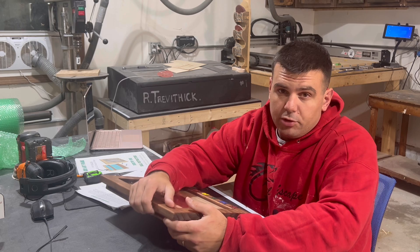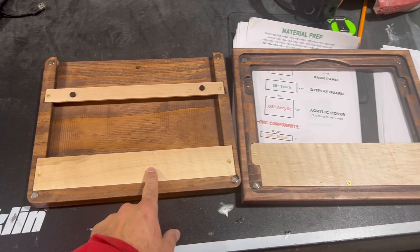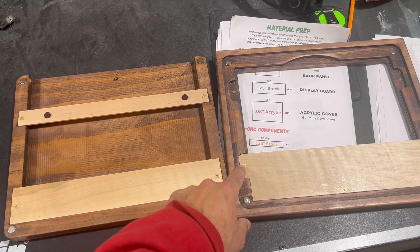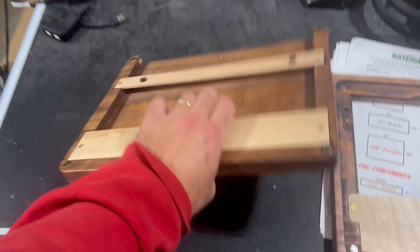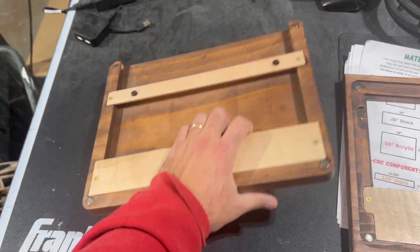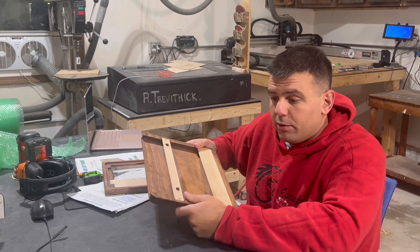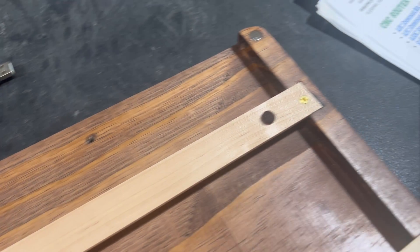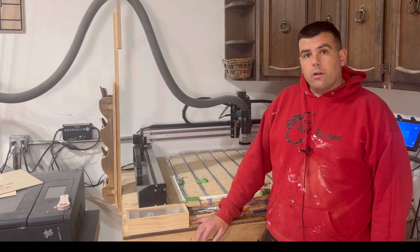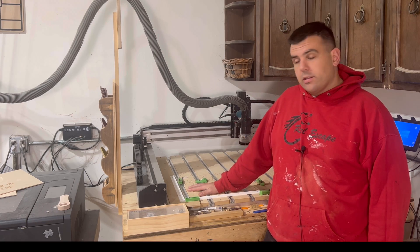Because this project is made on the CNC machine, some of the components are carved to fit specifically sized hardware. The smaller components on the front cover and back are held in place with screws — I'll put the sizes on screen. You'll also notice two small felt pads on the front and four on the back; those are totally optional, but I'll put the link in the description and build plans. The most important thing you'll need, designed specifically to fit this project, are eight neodymium fridge magnets from Amazon. These are carved to fit in pockets in each corner of both the rear panel and the front cover, and are what hold the two components together. Once you gather all your hardware, we can start cutting our wood down to size following the cut sheet on page 5 of the build manual.